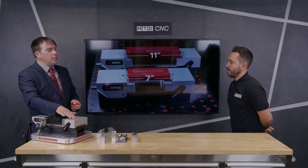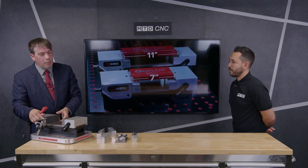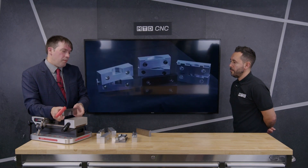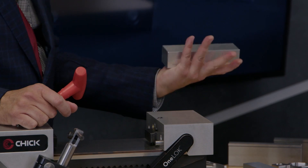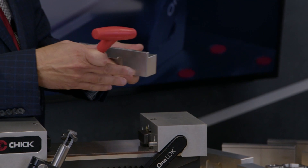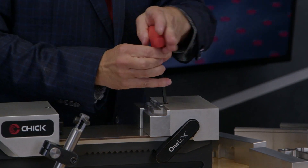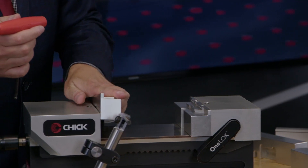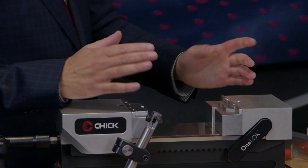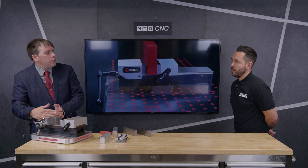On top, you can see these two screws here — these are to release the jaws. At the moment I have a set of stepped hard jaws in here, but I'm going to change that for a set of soft aluminium jaws. This is what our soft aluminium jaws look like, but this set has actually been machined for a specific job. It's just a couple of turns of the screw — the jaws snap into place, and they repeat very, very well. We get better than 20 micron repeatability, because there is a spring-loaded mechanism underneath that locates the jaws.